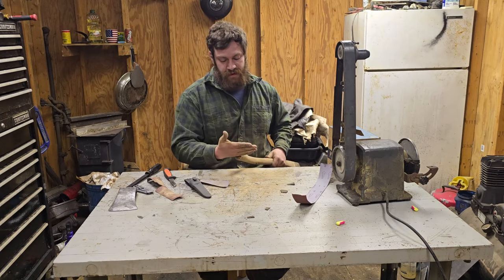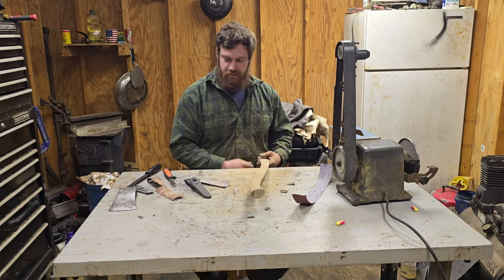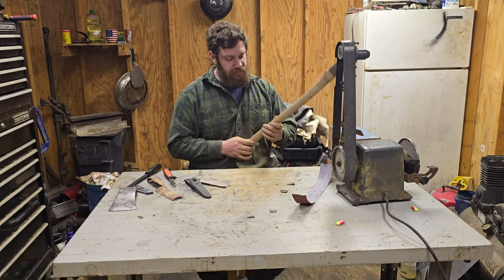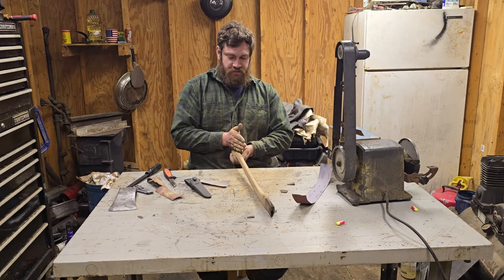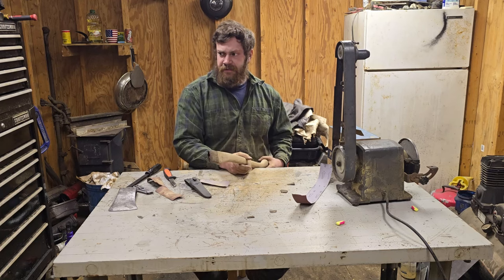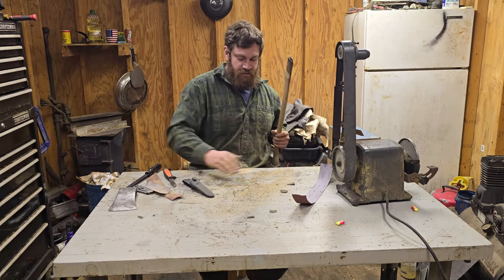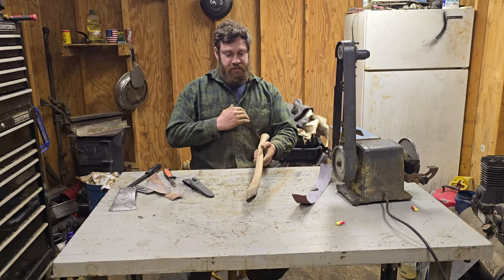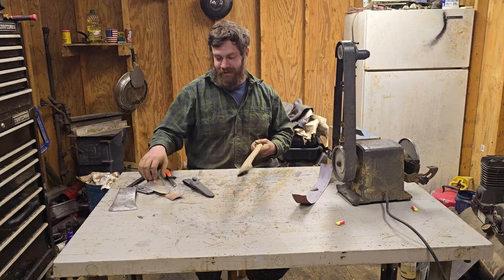most of the time if you have a grain pattern that is mostly sideways and you don't have a whole lot of run out on it, you're going to be just fine. Because what really gets you is whenever the grain comes across and it doesn't have a long connection through most of the handle. That's what really screws people up. And I think it's 19 inches and under for a handle. Zero difference. You will not notice a difference in the structure or the strength of your handle at all. Now, is it ideal to have a 90 degree grain? No. Do I care? No. It'll work just fine.